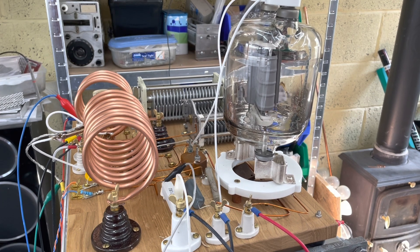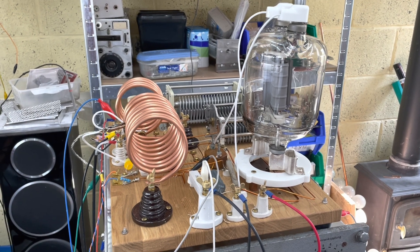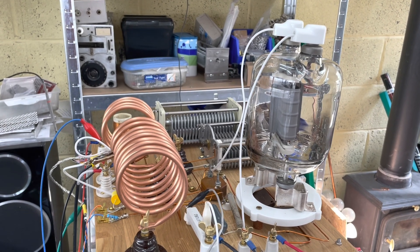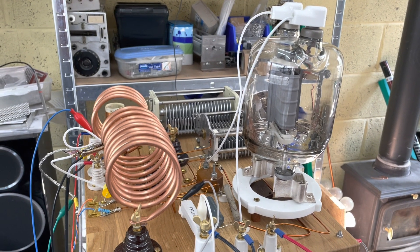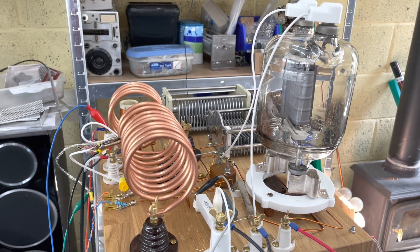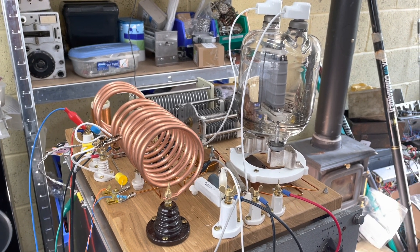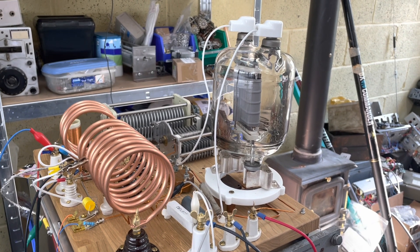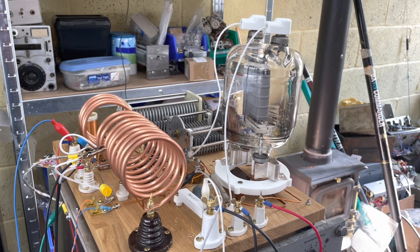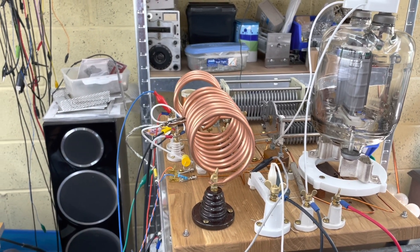As soon as you start going too hard with the HT, the oscillator starts to oscillate but the keying becomes less than perfect. It's everything's a bit of a trade-off with something like this — it's a simple circuit but it does work. The harder you push it, the more problems you get, because you're not really supposed to use an enormous triode like this in a Hartley oscillator. It's probably being a bit enthusiastic, but anyway we've done it and it works. I'll give you a quick demo and show you how much power we get out of this.